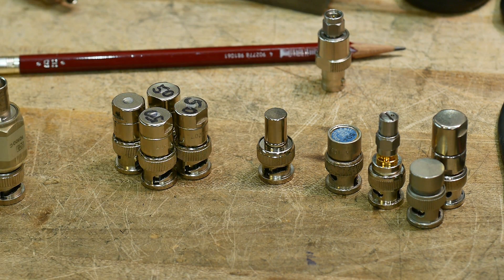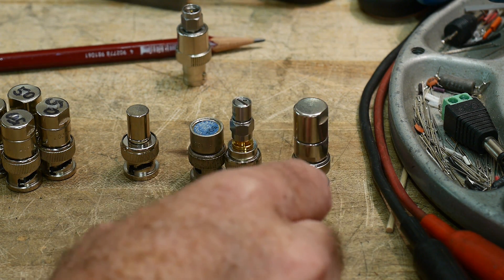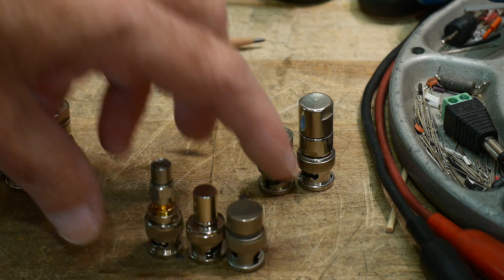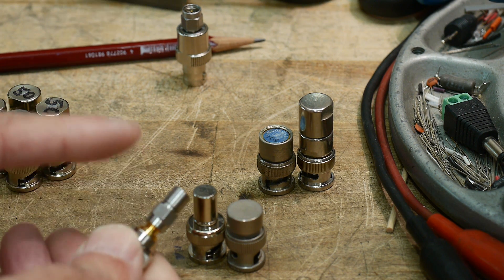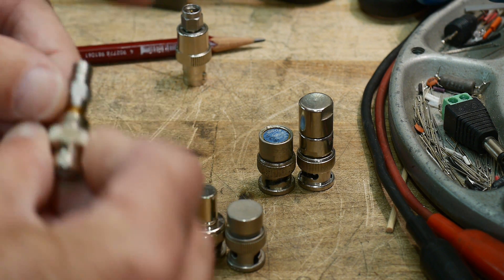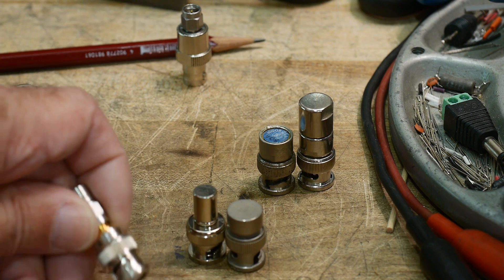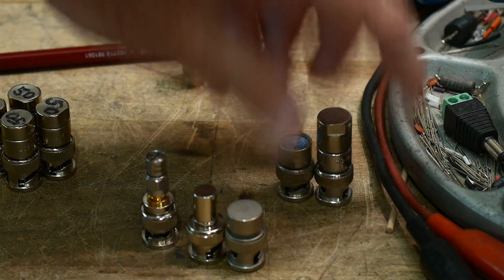Some I just have and don't know where they came from — well, I did purchase this one and this one, and these. So this one is my really expensive — I didn't pay a lot for it but it's a top-end — 50-ohm calibration standard, good up to 20 gigahertz, maybe farther. I forget who makes these... Inmet, yeah. This is really top-end 50 ohms for SMA. I put it on a BNC adapter just so we have a reference.